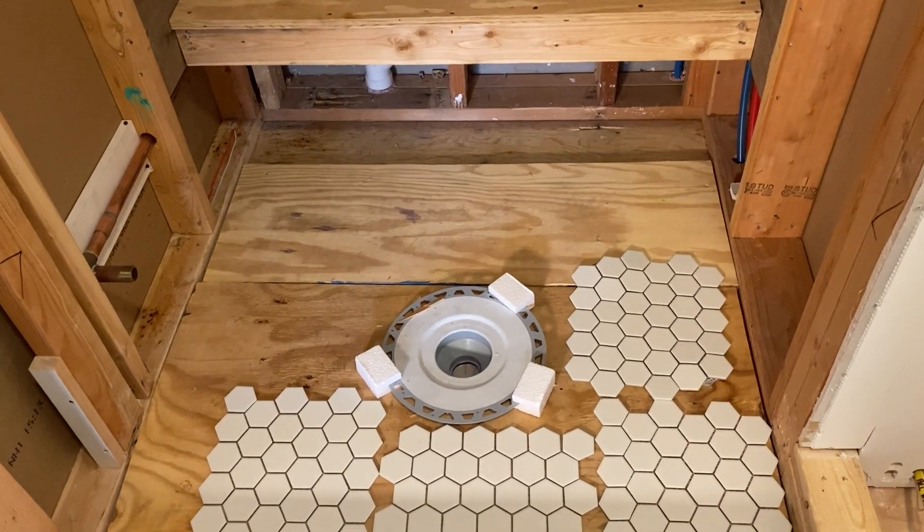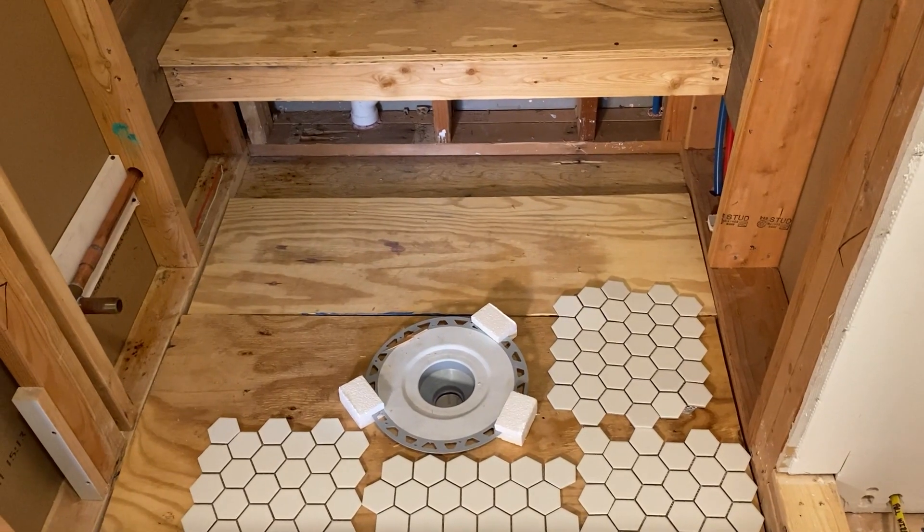Tip number six is a mistake I 100% made: not thinking through the project and how I want to use the space. We roughed in this bathroom 10 years ago — we just said 'make a bathroom' and I left it because I had young kids and didn't want to clean an extra bathroom. When I went back to redo it, I wanted a steam shower, which threw off everything. The guts of the steam shower raised the shower niche way up. When we added the bench, we needed to move the floor out, so I had to bring a carpenter back, which means the glass will have an extra side. Then I had to bring the plumber back because moving the floor out meant the shower wasn't centered on the wall. All this rework also resulted in the drain in the floor not being centered.